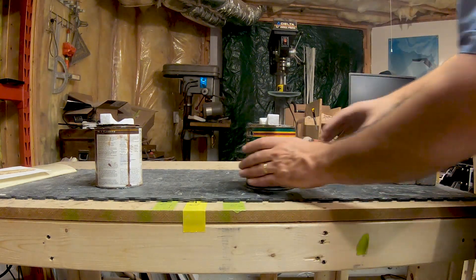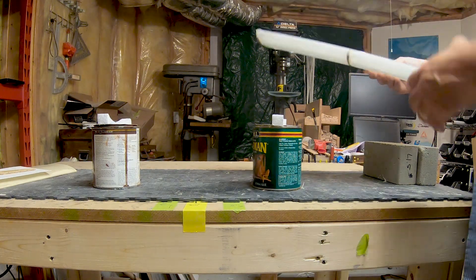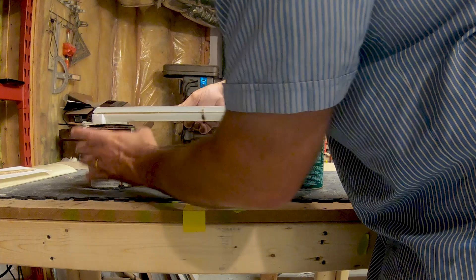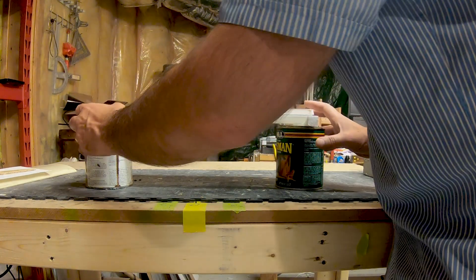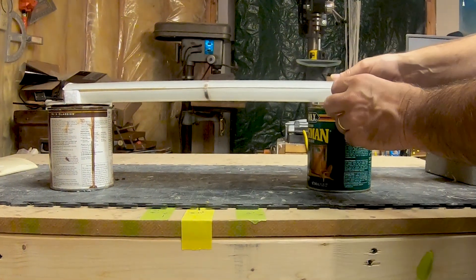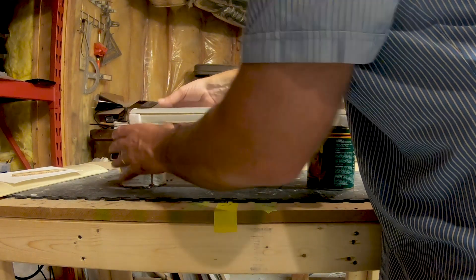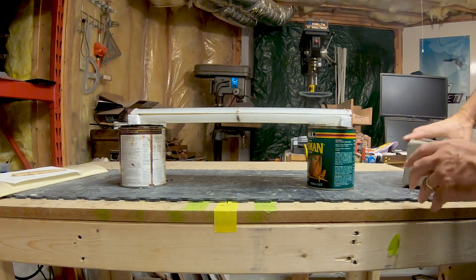Our test setup is pretty simple — I've got these two cans and I'm going to support the wing on the inner edge, then load some weight in the middle. I know this is not the true bending mode I'd see in a real aircraft, but it's the best I can do right now for these quick tests. I have some foam cut to a rough profile on the ends to keep the wing from being crushed on the cans and distribute the weight a little bit.